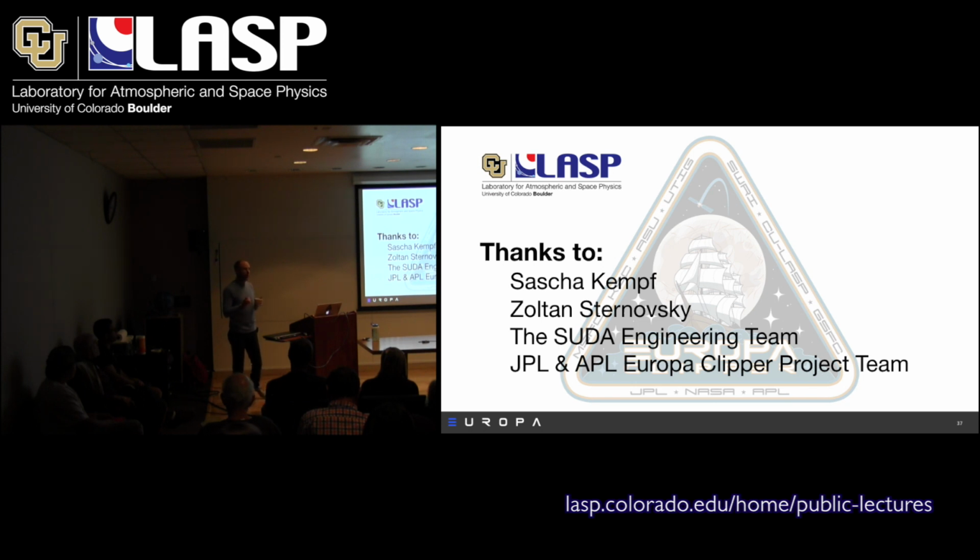They're made out of metal, either stainless or aluminum, and then we apply voltage to those grids, and so there's a wire hooked up to those. We actually control the shape of the electric field with some rings that we call shaping rings, and those just help us keep it smooth and control it. And we validate all this with simulation. As things fly, there are some ripples in the field that disturb things, and it's one of the error sources in the instrument, but we try to keep it low enough that we can still make the measurement.